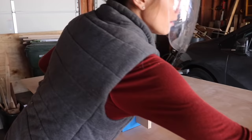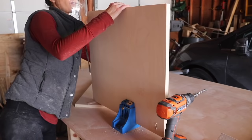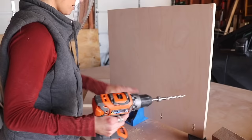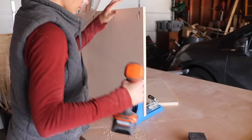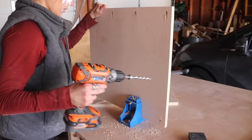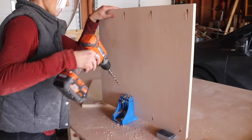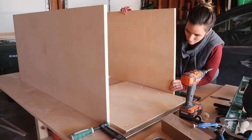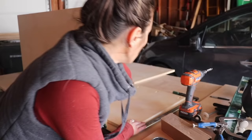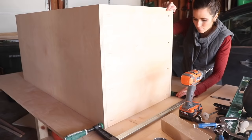The closet drawer system is going to be my first time building like a dresser of sorts. I'm just going to create a box first, and this will be put together with Kreg jig holes. I find my Kreg jig to be just the easiest way to get a joint like this, but there are definitely lots of ways — and probably stronger ways — that you could construct the box or drawers. I drilled Kreg holes every 6 inches across the shorter pieces of the top and bottom, and then when I had my four pieces ready I assembled the box. I made the height to be 48 inches, designed so the screws go into the longer pieces of plywood.